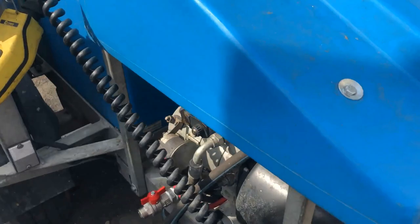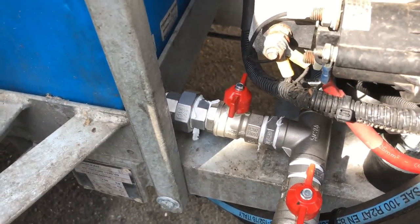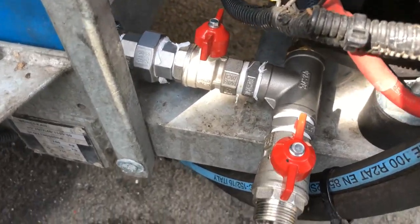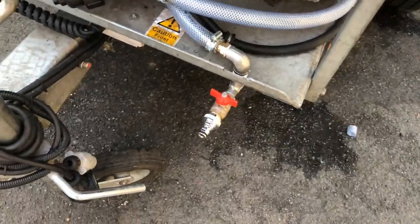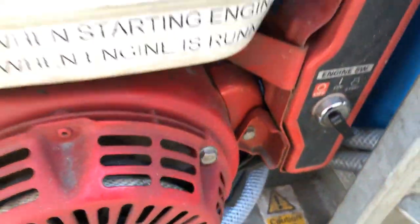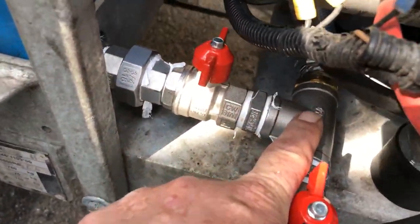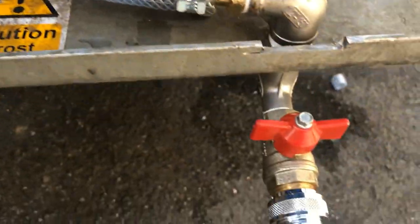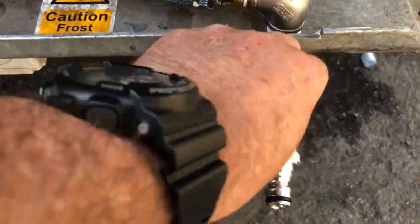How we've set up now — we've changed it all to stainless steel. What we've got is we can isolate the tank. So when we close it to that position the water in the tank is closed off. We've got this position here where you can open and close this valve. In frosty weather what I'll simply do is open this valve, keeping that one closed, draining it all off at this point. You've also got another valve at the front. Now this valve, as you can see, is letting air into the system, so all the water in this filter and everything goes right the way around — that pipe runs to the other side. The water comes in normally through here, runs into this side, then transfers all the way around into this filter at this side and into the pump itself. Always make sure that valve is closed off — if that valve is open it'll take air in at that point and the pump won't work.